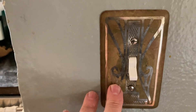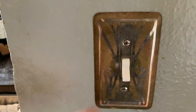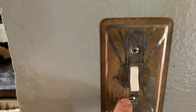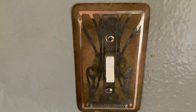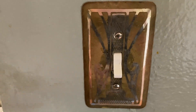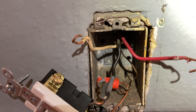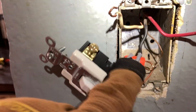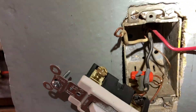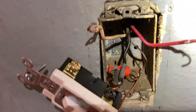This is the other switch you haven't seen. Power's supposed to be off - hmm. So we've got to be careful going in here. I don't know if there's another circuit running through this box or something crazy. This circuit runs all over the house and runs all kinds of weird things, so I think there are a lot of splices and crazy stuff going on somewhere. But hopefully that's all on the line side, not the load side of this. I'm going to put my gloves on and open this up.